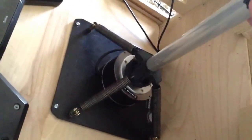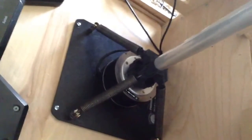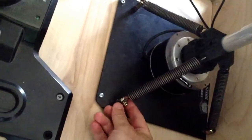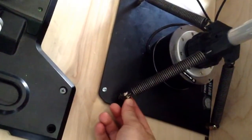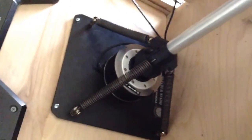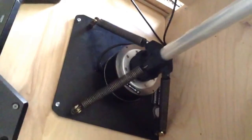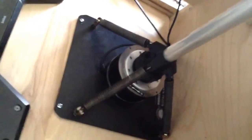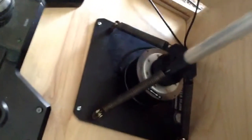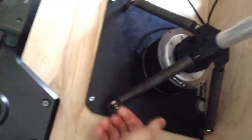Then once these are installed, you take the spring and you bend the stick in one direction. You might have somebody hold it for the first spring, and I just kind of use my body to hold it. Then I slide the spring in position, then I take the clip right here and slide it in, then I flip it down, and it's done. Then the second time you go to the opposite direction, you put the opposite spring on. Once that's on there, it's kind of balanced. Then you'll do the last 2 springs.